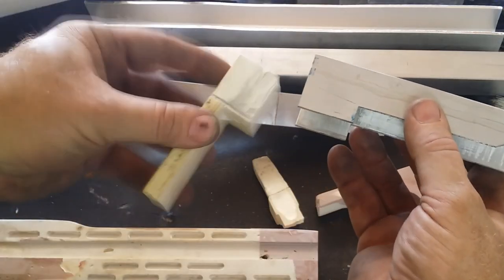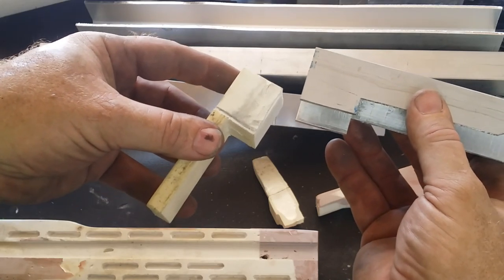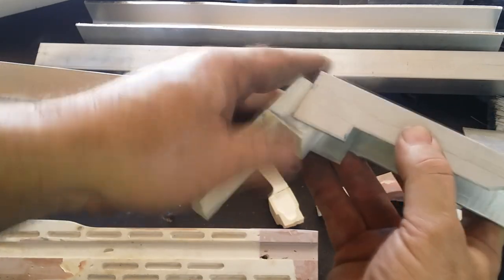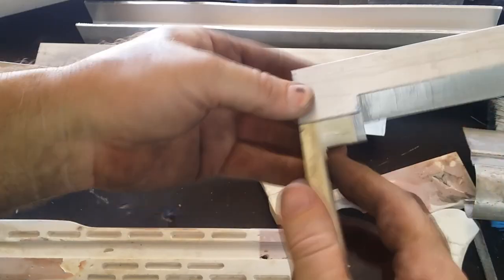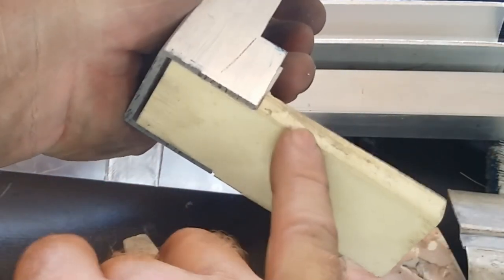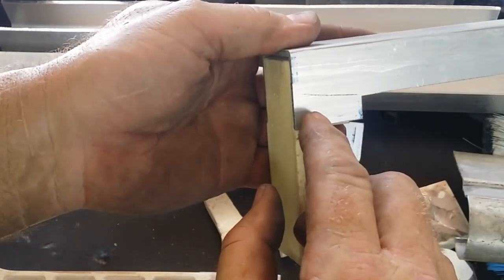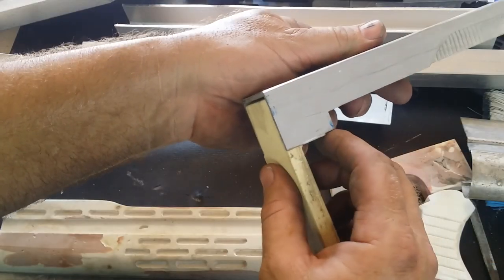I've seen a number of different versions of how this rear piece is made, and the version I'm going with is one that has a solid piece. I've gone back to using the resin piece that came with the kit — I'll cast that up in aluminium so that it becomes a solid insert that slots in there. This hasn't been cut to the right size yet so you can see there's a bit of overlap. That's because I'm casting it a little bigger than needed so that when I mill it back it's a very neat tight fit. That will allow me to tap through into that solid piece to act as both assembly and to add the ring they use for the shoulder strap.